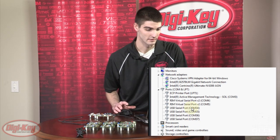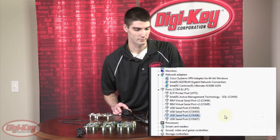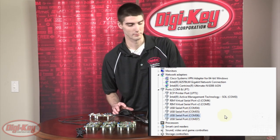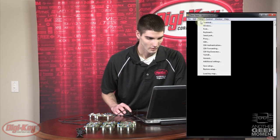In my case, it's COM 34, 35, 36, and 37. Your numbers may be different, but they should be four sequential numbers. Dust Networks provides a couple of different ways of interfacing with your network. The command line interface, or CLI, is ready to go as soon as the drivers install, and that uses the second highest enumerated COM port — in my case, COM 36. So we'll go ahead and start up our terminal software. I'm using TerraTerm, and we'll set up our serial port to use COM 36. The default baud rate is 9,600, and the rest of the settings should be 8, none, 1, none.